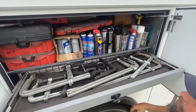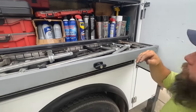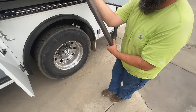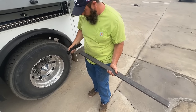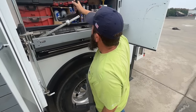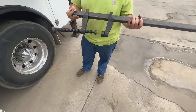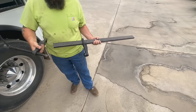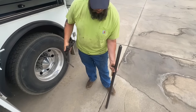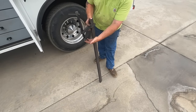Top drawer — we have some big C-clamps. These Fireball Tool clamps are pretty badass. You can set that up on any tube or solid bar you have and make a clamp — you could put two on there and really make it however you want. I was most intrigued because if I needed to use this as a dog clamp, I could put this on, have this piece however long I want, cut it, weld it, and use it to push down on metal — without having to cut up one of my good clamps.